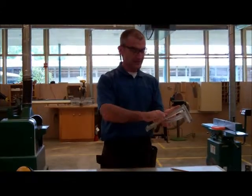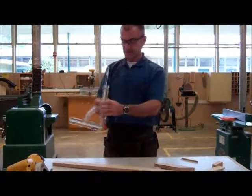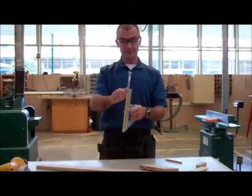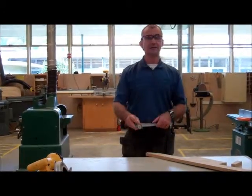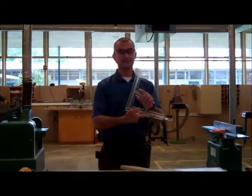A lot of great other applications are if I want to do a stud layout — I offset at 6 inches and there's my stud layout at 16. Or if I'm looking for a center bolt on my sole plate and then scribe my center line on my sole. All right, Trimetric — there it is. Let's get started.